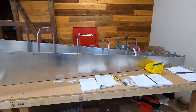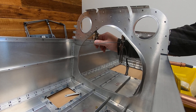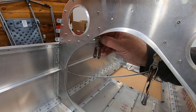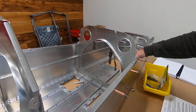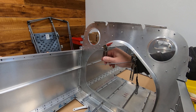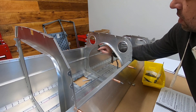Tell us about some of the issues you had. There are basically these U-brackets, and the couple of issues I ran into were that the documentation really doesn't do a good job of describing whether these U-brackets should be tight against one another or not. Similarly, the bushings you fabricate — it's unclear whether there should be any play in there. It sounds like they're supposed to just be snug. These nuts do have nylon inserts, so it's a locking nut. I ended up ordering new ones because in the process of fitting it, thinking it was supposed to be snug and tight, I ended up having to bend the U-brackets to tighten the nut on the other side.